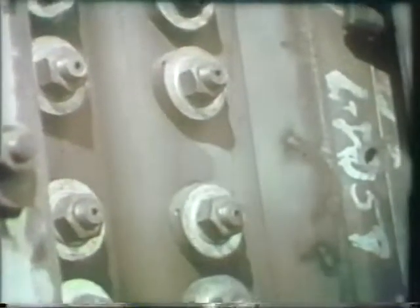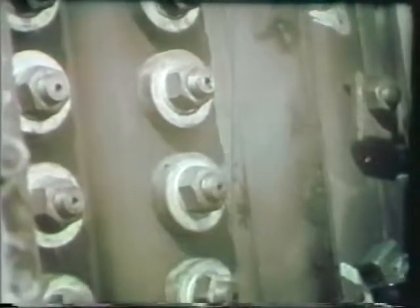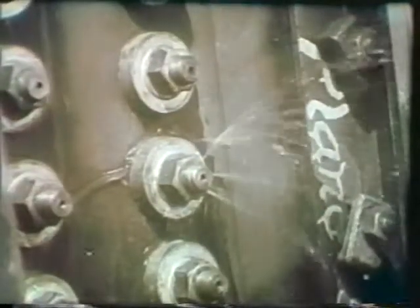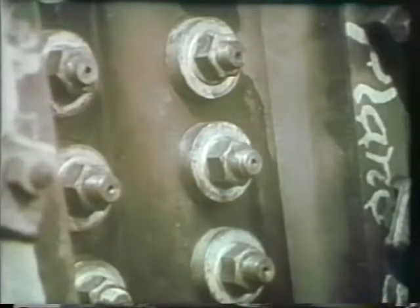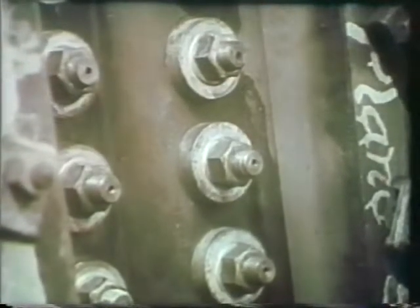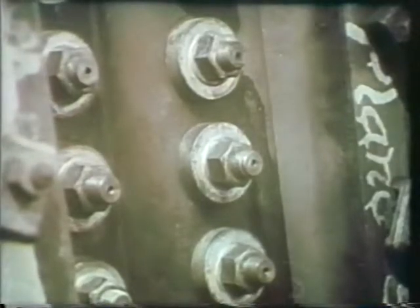As the hydrostatic test is run in the boiler, look for leaking plugs, a condition usually caused by the presence of foreign matter or by small nicks in the gasket. In such a situation, the leakage can be corrected only by breaking down the fitting, removing it from the header, and re-cleaning or replacing the necessary parts. By doing the cleaning job right when installing handhole plugs, you will avoid the necessity of redoing the job.